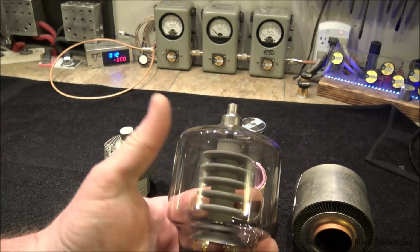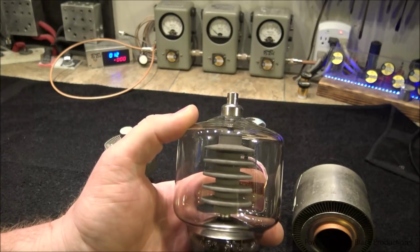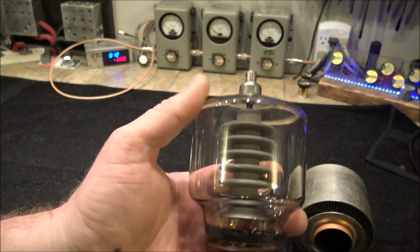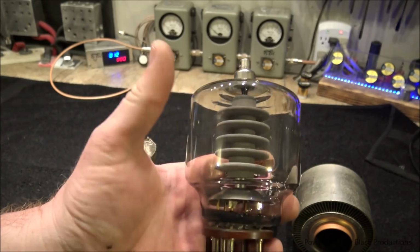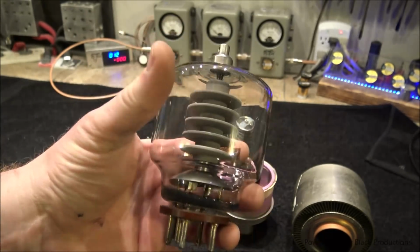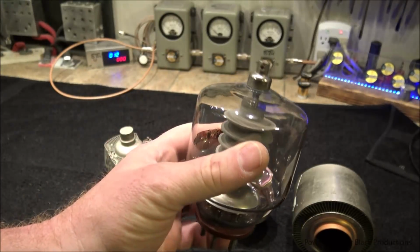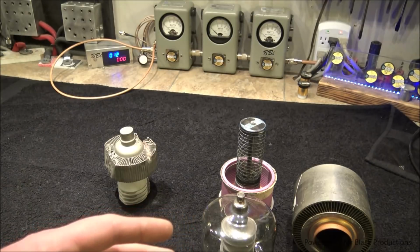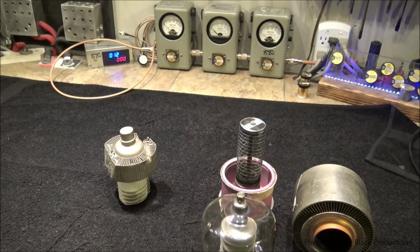The heat has to travel through this vacuum. So it means we have to space this glass, which has a fixed melting temperature, a certain distance away from the anode body itself, so that we don't have vacuum collapse, because we don't live in a vacuum, even though the tube does on the inside. We have constant air pressure applied to the outside of the glass. So when we did this, we were limited on size when they developed this style of tube, which was basically all the peanut tubes up till we decided to figure out ceramics.